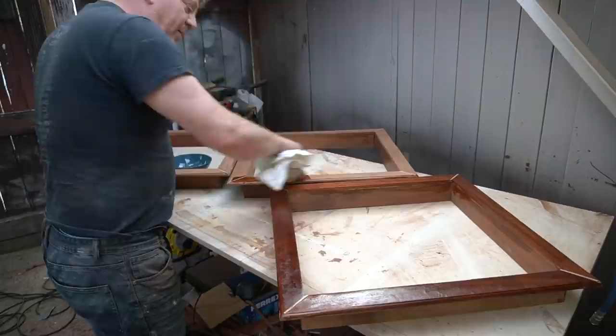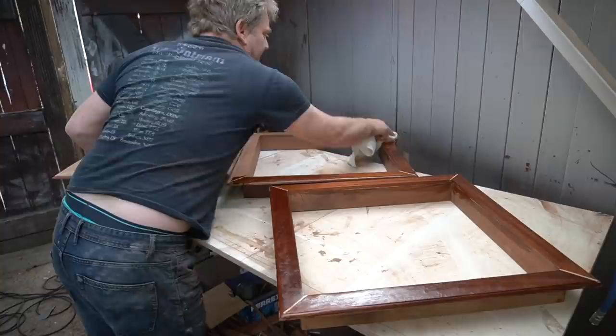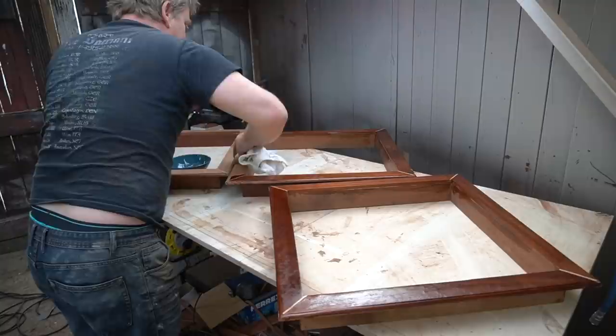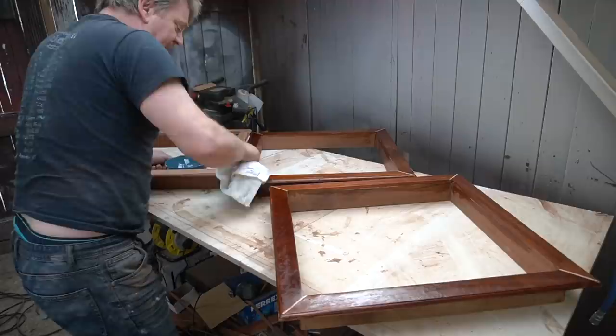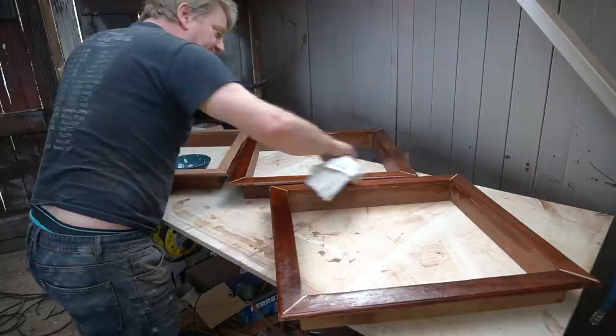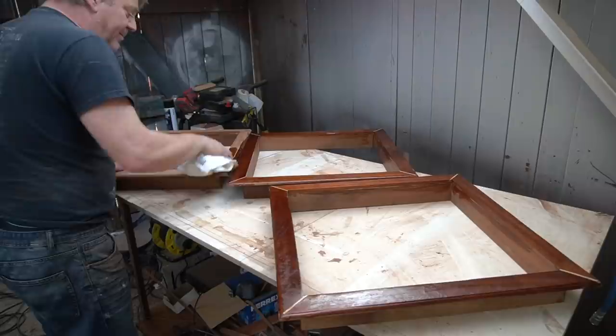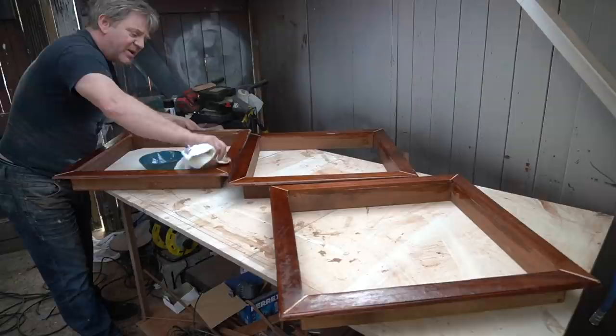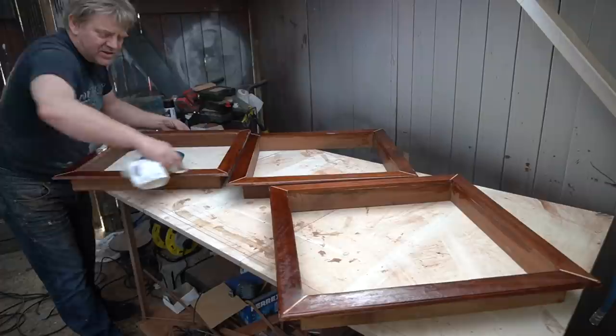So much so, I think I'm going to build them just strong enough. Oh, look at that, that's stunning. Some of this wood's lovely. Just strong enough so that we all know that you should never keep your hatches open when people are on deck. It's kind of a no-no, but we also know it happens from time to time and accidents do happen and people step down an open hatch and that can be really, really nasty. Having a fairly sturdy frame with a supported mosquito net on the inside of the hatch that allows air through, that's not designed to be stood on, but might break your fall if you did step through an open hatch. It's sort of design against stupidity, which in my world is quite a good thing.